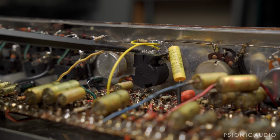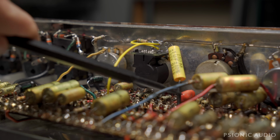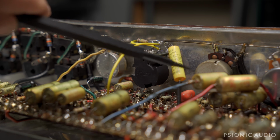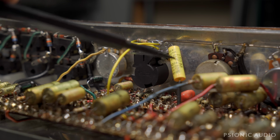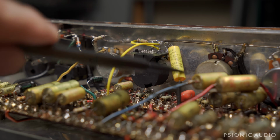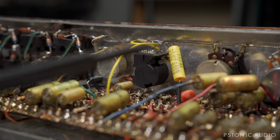And I'm going to be replacing this not very lovely installed Mallory 150M with a different 100 nanofarad cap when the time comes. But for now, this is the one that was in the amp when it came in. Because I want to move this a little bit farther to the left, and there's not the lead length on this one to really do that. So I'm going to be mounting it down and to the left so there'd be more room for the top boost card.